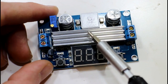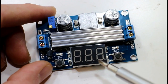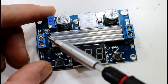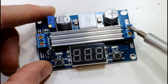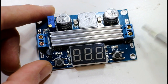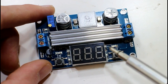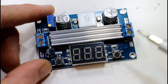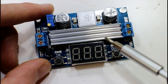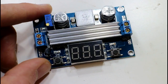According to the specs, this one is about 96% efficient, so about 4% of the power is lost, which isn't bad. The input voltage is between 3 and 35 volts at 7 amps, and the output is between 3.5 and 35 volts at 6 amps. It's rated for 75 watts, so at 6 amps you couldn't do 35 volts — that would be around 200 watts. It's more like 11 or 12 volts at 6 amps.